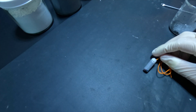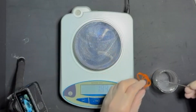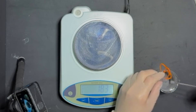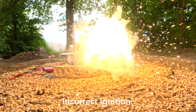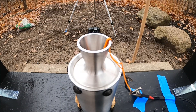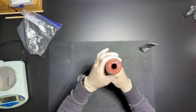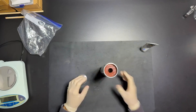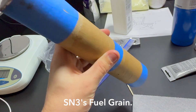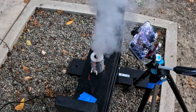Another method was inspired by Tech Ingredients here on YouTube. I used a mixture of chemicals to create a hot flash which would then ignite the propellant. These chemicals were stuffed into a straw which had an e-fuse in it to ignite the mixture. This took a long time to perfect because if the mixture was packed too tightly, the igniter would explode and not burn controllably. It also didn't work every time. During SN3's first static fire there was an igniter issue. After investigating, the issue was due to the cold temperature of the propellant since I was testing in the winter. This igniter would only let out a short burst of heat which wasn't long enough to ignite the propellant. To fix this, I lined the propellant with black powder. Overall, this method worked but the igniter was tedious to make and unreliable at times.